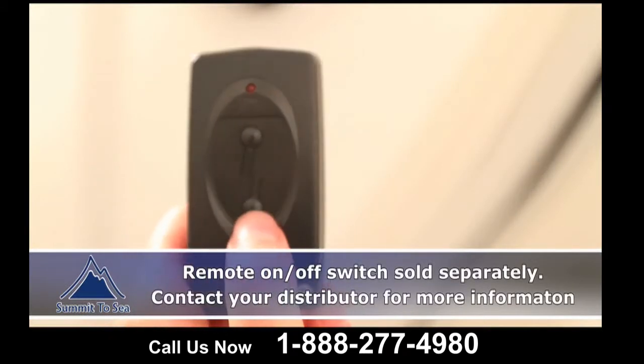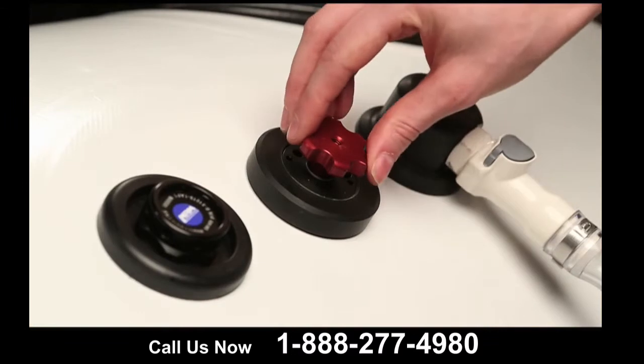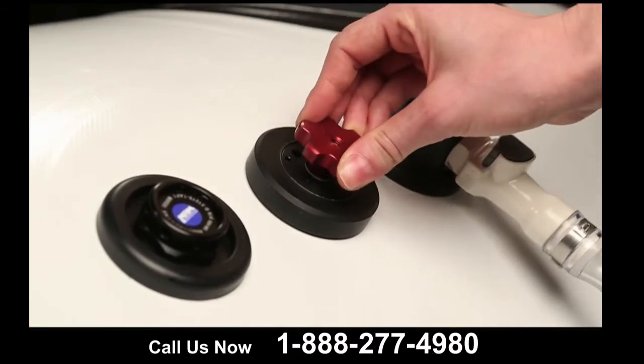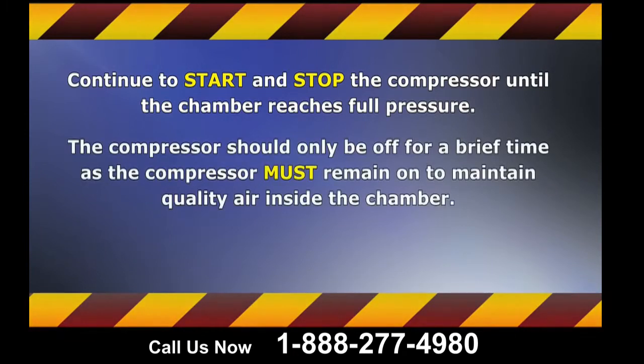If the pressure is not relieved, temporarily turn off the compressor until you feel relief. Also, opening the dump valve may relieve this pressure. Continue to stop and start the compressor until the chamber reaches full pressure. The compressor should only be off for a brief time, about 1 minute, as the compressor must remain on in order to maintain quality air inside the chamber.